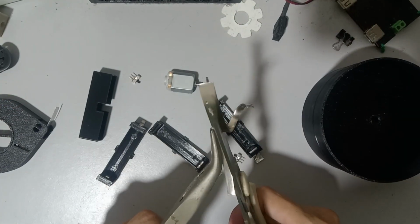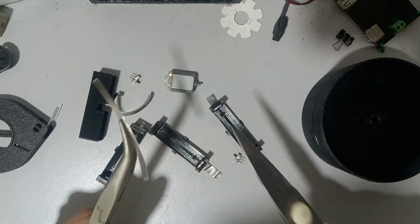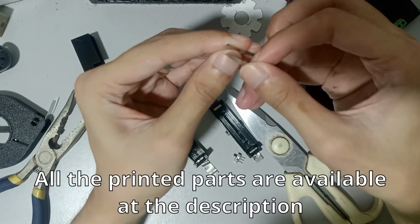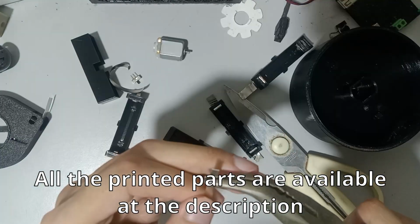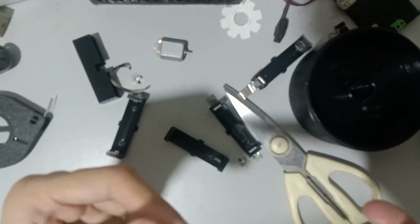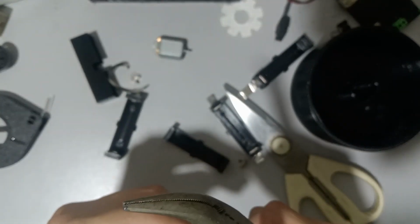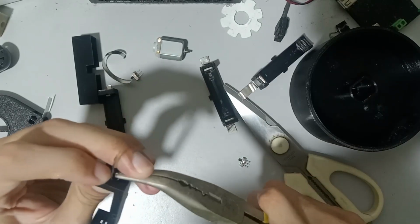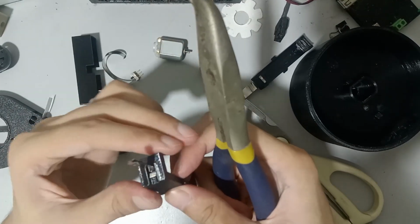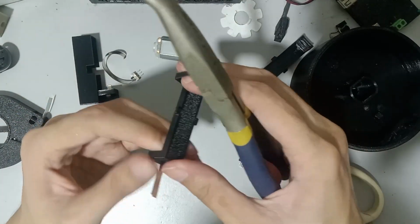I started off cutting a length of nickel strip, then cut it in half to make it narrower in the middle. I fold the cut strip earlier so that the strip can make contact against the battery terminal. Make another bend but don't flatten it, then put them both through the slot in the battery holder. Add more strips as you see fit, because there are batteries that are somewhat shorter than usual, and this also decides how strong the holder will grip the battery.